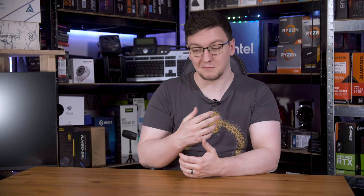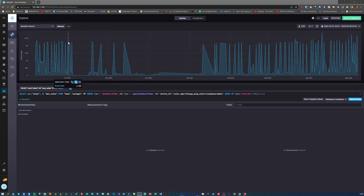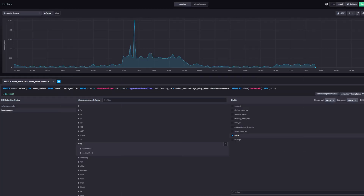I've had Home Assistant recording data since basically when I installed the solar power system, and since then I've used about 300 kilowatt hours. The fridge is the thing that's plugged in pretty much 24/7, and over the winter I've been letting the washing machine and dishwasher use some of that power too. Although as we get into summer, I'll actually be disconnecting them and focusing on more constant loads like the 800W air conditioner. Looking at the usage graph, you can see the spikes from the washing machine and dishwasher drawing around two kilowatts, at least for a few minutes at a time.